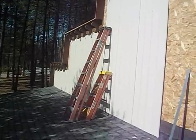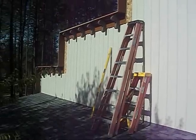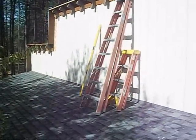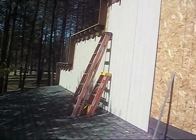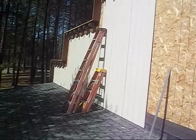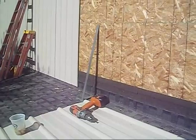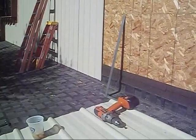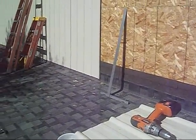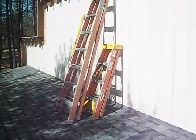We're back again. Bob had to leave and go to the house to do a couple of errands, so in the interim I'm policing up the area and taking things away that we don't need anymore. We got one half of the west side of the facade done. If you look at the bottom of the metal there you can see how the shingles wrap up on the facade wall, and the bottom tail of the tin comes down — the shingles would be the flashing, and the tin just rides over the top of the shingles creating a water barrier.